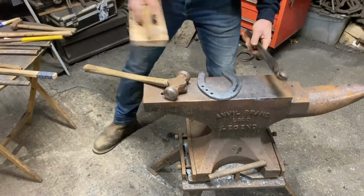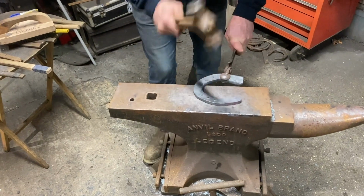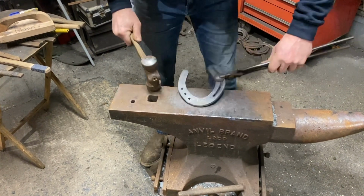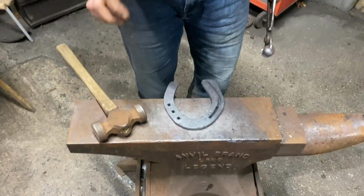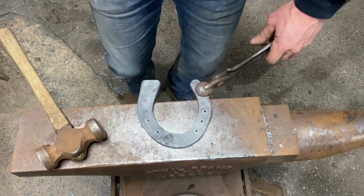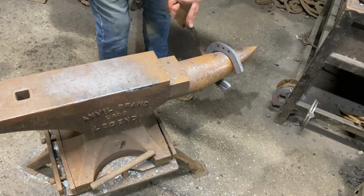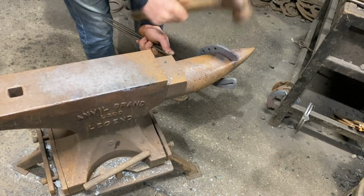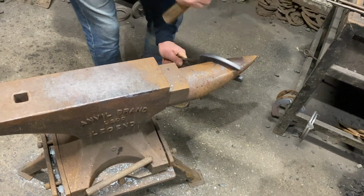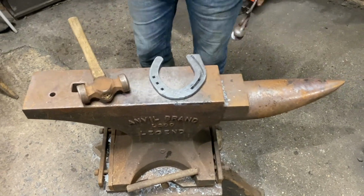Again, before you flatten, flat brush, clean it. And now I take just a few seconds, I look at my toe. Is my toe about right? Can I set that toe? I believe I can. I need to just edge this a little touch. So this is a set toe, and this shoe's finished.